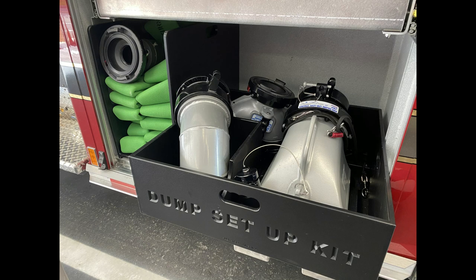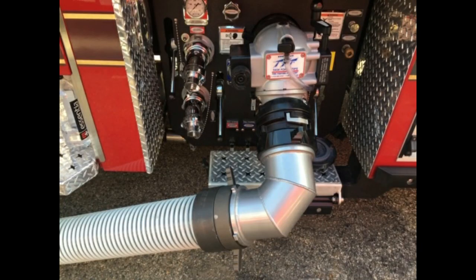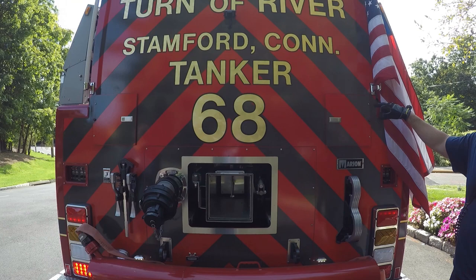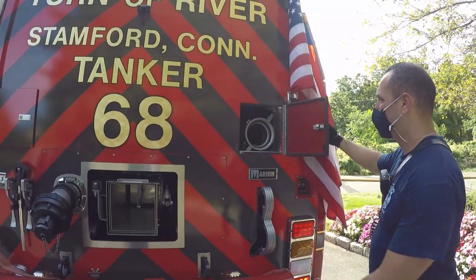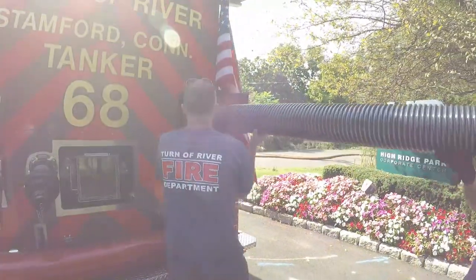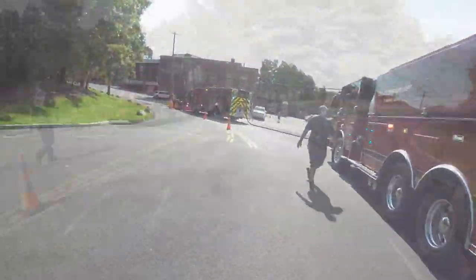Stanford's tankers will also supply the necessary equipment for the dump site. This dump site setup kit will include a high-flow, low-level strainer, a 90-degree suction elbow with Storz adapter, and a Siamese in case one wasn't left with the 5-inch by a second due engine, along with other essential equipment. Also considered part of the kit is the tanker's hard suction. These 13-foot hard suctions are located at the rear of the tankers and are accessible at ground level, preventing any personnel from needing to climb on top of apparatus and preventing potential fall injuries.